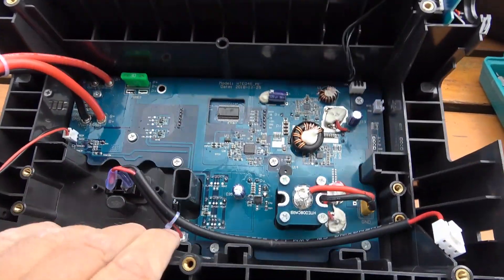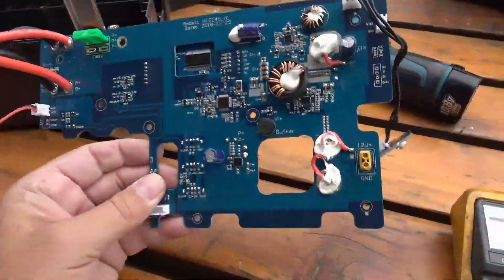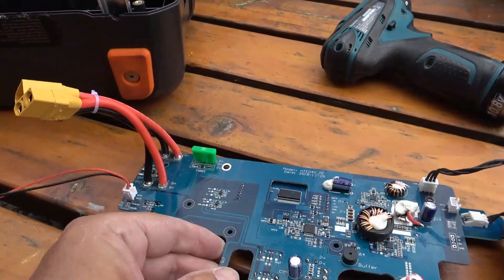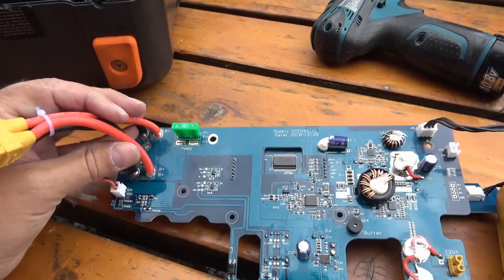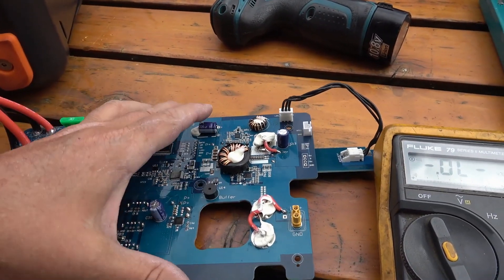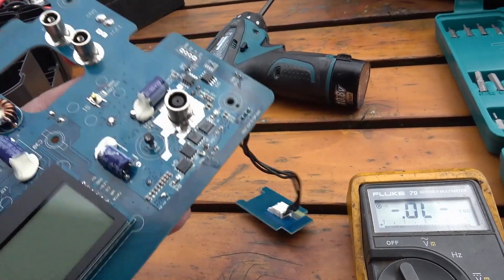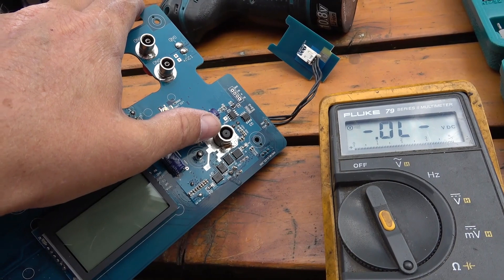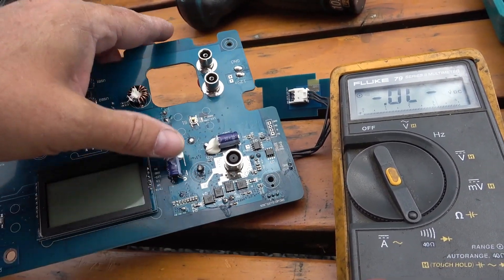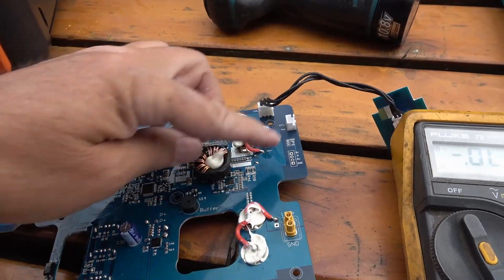We've got the front board that's mounted — I'm just going to pop those screws out for a closer look. Once again really easy to get out and unplug. Everything's laid out in a really organized manner. Over here we've got the voltage from the batteries coming in, probably around 21 volts. This little circuit on the corner probably cuts that voltage down to 12. You've got your 12-volt output circuit down here, and your input circuit here which takes care of the charging. It's fairly lightweight, which is why it doesn't have a very high charge current capacity.